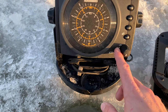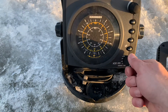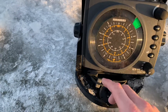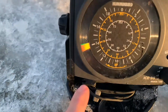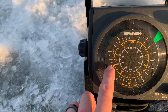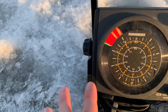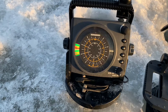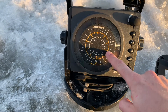You've got these different functions or different depths. You've got 1X, 2X, 4X, 10X, and those relate to the dial here in the center. When you first turn it on and you're at 1X, you're looking at this white outside dial. What you want to look for is hard bottom. I know hard bottom here is about 15 to 16 feet. If you look right here, you can see this really hard red line — that's bottom. Anything above that is fish. So there's basically fish from 14 feet right down to about bottom. If you increase it to 2X, now you move to this inside dial, so now you're on the yellow dial.